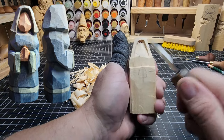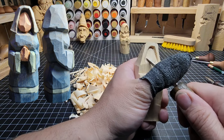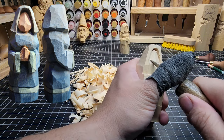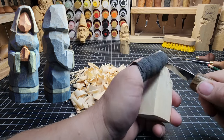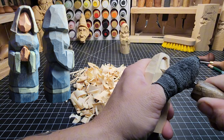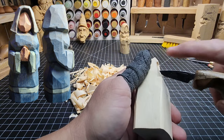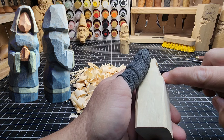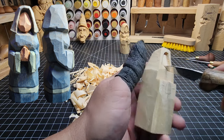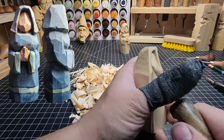So right in line with that, straight into the carving right here, okay? Now I'm going to try to make that point go deep, and I'm trying to come out with the base of the back of the rough out knife right here. So I'm going to angle this in, and let me show you the angle, right? It's right here. So that tip is going in pretty deep, and I'm just barely in at the outer edge there, right? I'm going to do the same thing right here, going straight up and down.